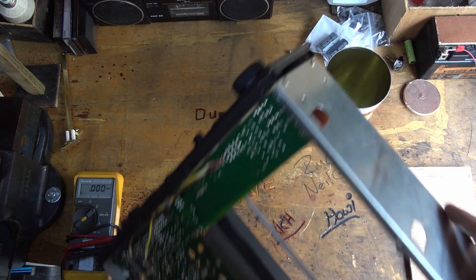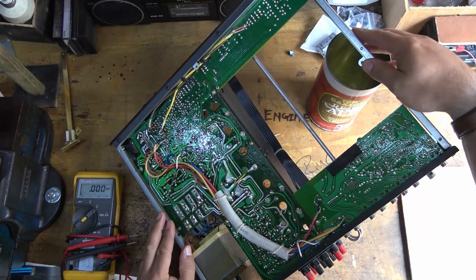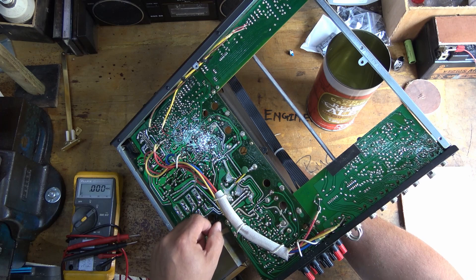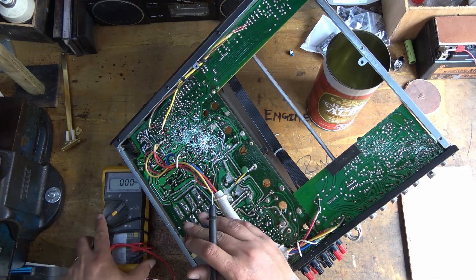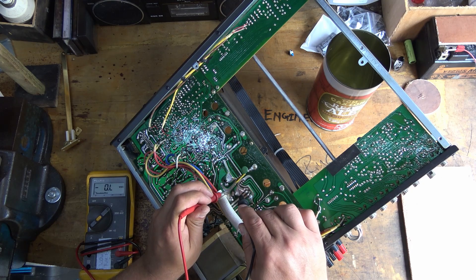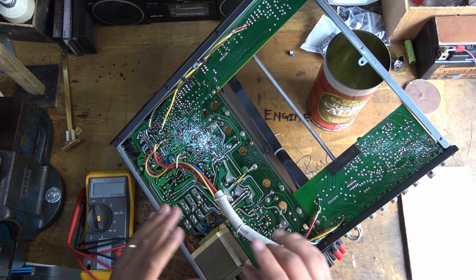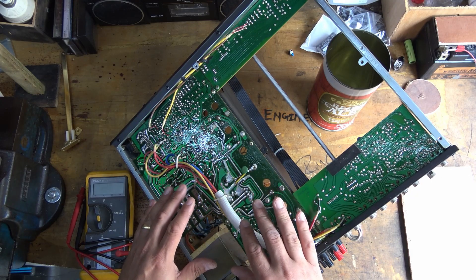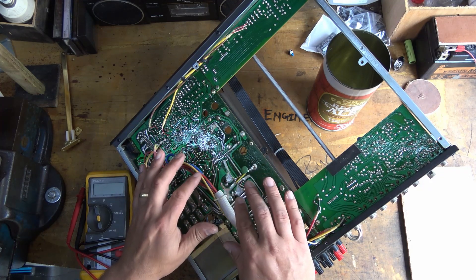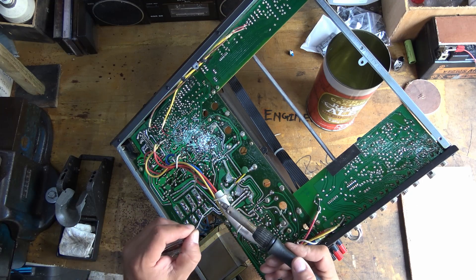This beer brewing pot comes in handy — never throw anything away — because it holds the amplifier shell up perfectly so I can get my hand underneath to access those capacitors and apply the soldering iron on top. One thing you should be aware of: looking at the DVM, there's still nearly 14 volts in each of those capacitors. It's unplugged and not running, but those caps are still holding charge. It's not mains voltage and won't kill you, but shorting it against other components could cause problems with silicon.